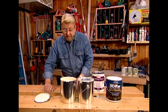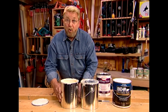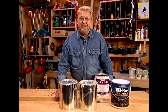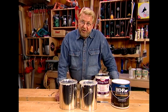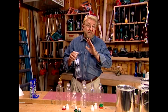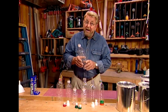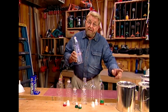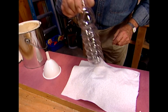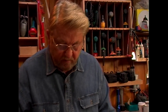Over time, a little bit of paint stored in a large container gets pretty bad, and eventually becomes totally unusable. Also, when I've got it stored in cans I forget which paint goes where. So I've come up with a good leftover paint storage solution. I've started saving plastic water bottles of all different sizes. The key to keeping leftover paint in good condition is to minimize the amount of air in the container, so I match the bottle size to the amount of leftover paint. A roll of masking tape keeps the bottle from tipping, and a paper towel catches drips. If the paint has loose debris, I put a paint filter inside the funnel.